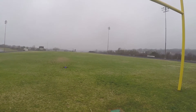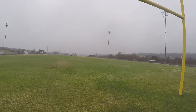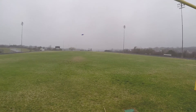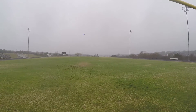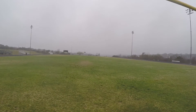The default settings on the CC3D - it's not super snappy but it's very flyable and works quite well. I did program another bank with a little bit more - a mode on the CC3D called Ratitude - which actually lets you self-level, but then you can push the stick really far and roll it. I need to adjust it a little bit more as it's a little bit slow right now, but that's advanced stuff.